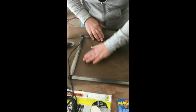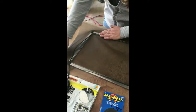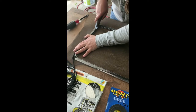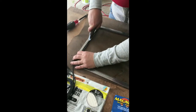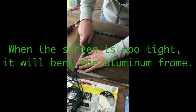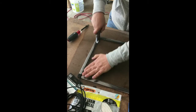We've got one short side and one long side done. The tricky part is trying to keep it just a little bit taut while you roll your spline in — that's going to keep all those wrinkles out. When you press the spline it will pull the screen kind of tight, so you don't want to hold your screen super tight because that'll be too tight. It's kind of a delicate balance — takes a little finesse and a little practice, but after you've done one or two you kind of get the feel.